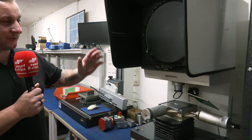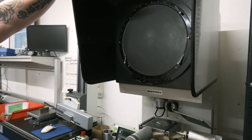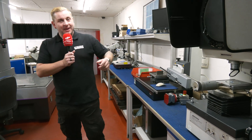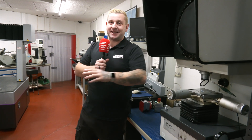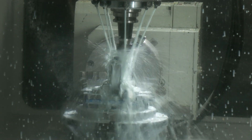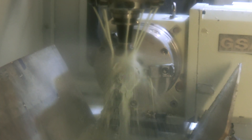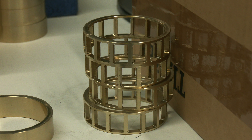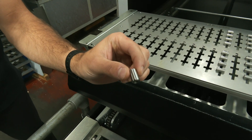I think I'm stood in front of the oldest machine in here now — this is a shadow graph. I've seen these before but I've never actually used one. I think these were the ancestor of the CMM — this is where inspection started. Wow, I've learned so much about bearings today. It doesn't matter where they go — whether it's paper mills, the British steel industry, or even vintage cars from the 1930s — they all have to be super precise and need all of the complex operations we've just seen. Bearings can be made out of any material, from hardy steels and stainlesses down to PEEK and Teflon. Have you ever heard of a Teflon bearing? Thank you for watching Swarf and Chips.